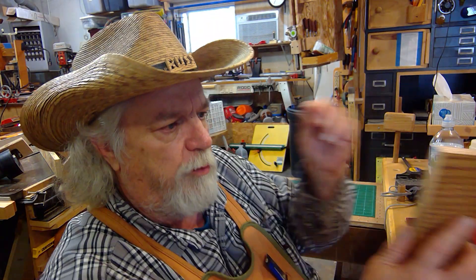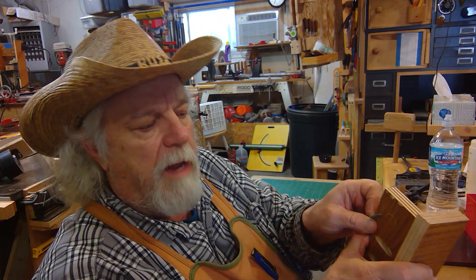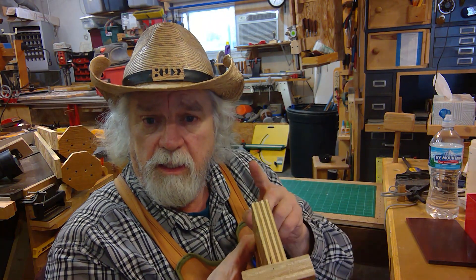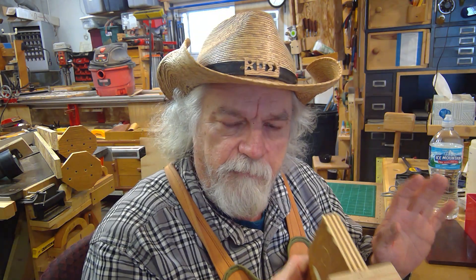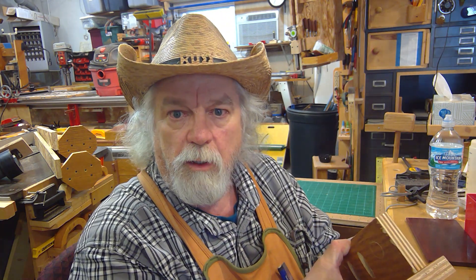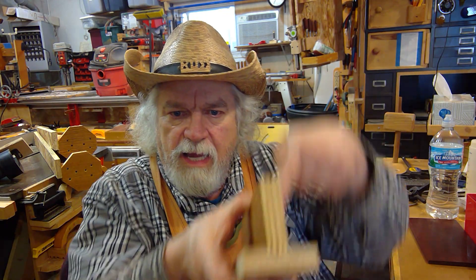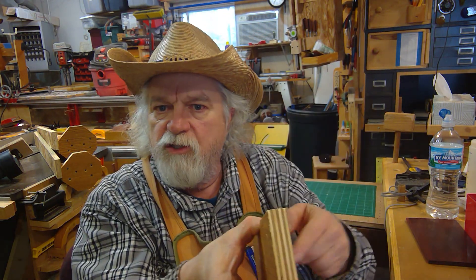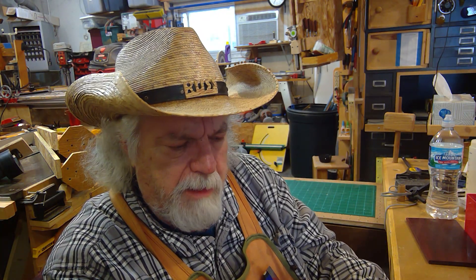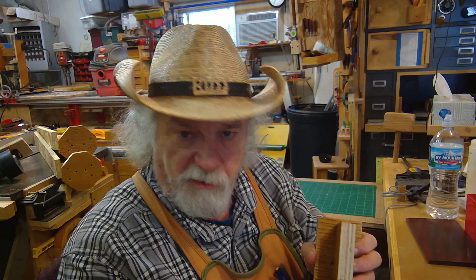With that in mind, you put a screw in and bring two pieces of wood together. If Norm Abram was going to do this, he would cut himself a little dado down through here, drop this in with glue, and then — which was very smart, and he did it on virtually every single plywood joint he did using the dado with glue — he came back with his brad nailer and toenailed from both sides along that joint.